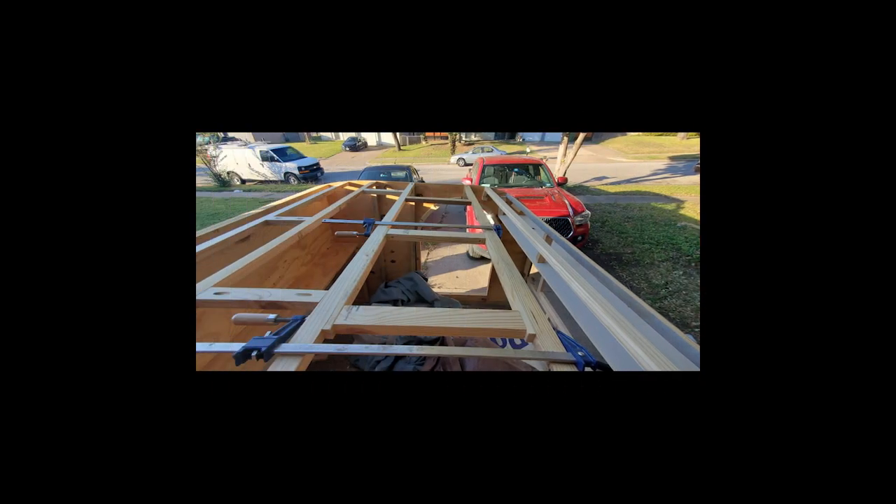So there are a couple of things to note in this picture. One, I did go ahead and get the framing for the vent finished. It is toenailed into the spars as well as glued. Also in this picture, you'll notice I have all the spars connected via supporting beams — or supporting spars. Once I figured out that this whole entire thing is a torsion box, I realized I had to finish putting those support beams in before I could actually install the roof into the camper.